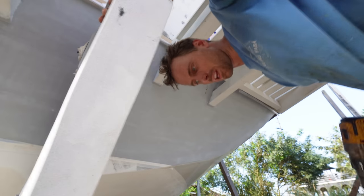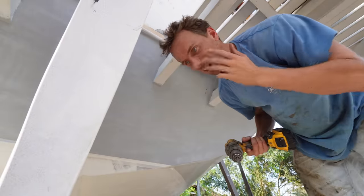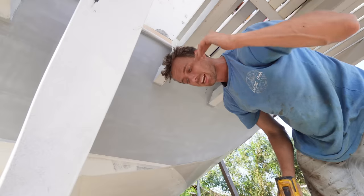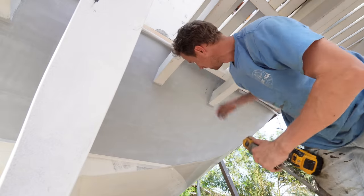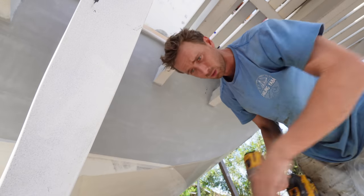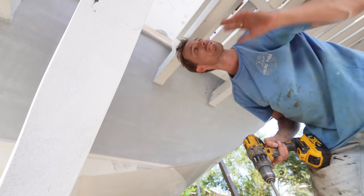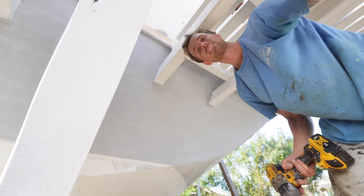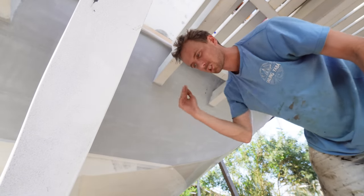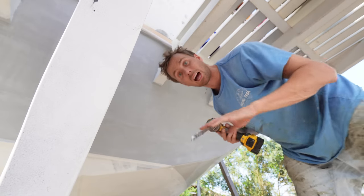The wire didn't fit through the first hole, which is not unexpected. So we've got a slightly bigger one here, the next one up. And this big one actually allows me to drill a bit higher, as the drill doesn't have to pass under the beam. So we are going to plug that small hole with some wood and epoxy, and this one is going to be the correct one. And higher is always better, because this kind of points upwards into the cover board, and I'm not going to drill into the cover board. So we're trying to go under that as high as possible, and this allows it to go higher.